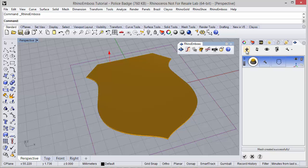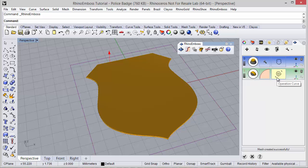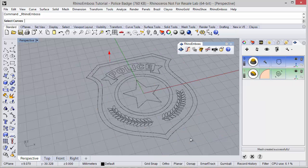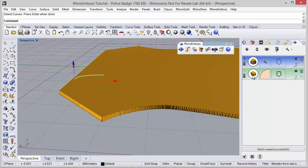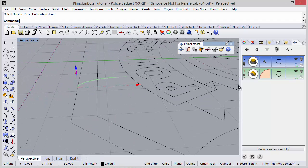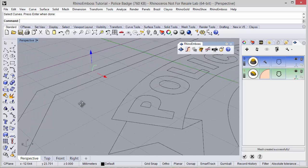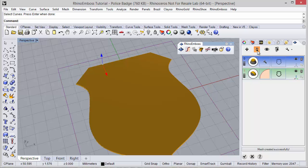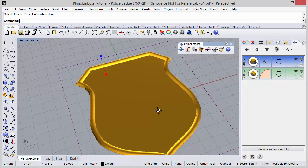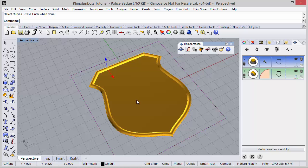Now I will add a new operation, in this case operation by profiles, and I will select the curve — in this case two curves for this operation. In here I can adjust the gumball, I can hide previous results, also the previous gumball, and adjust this one exactly how I need. So I just need to show and refresh, and as you can see, the profile was successfully added to the previous operation.